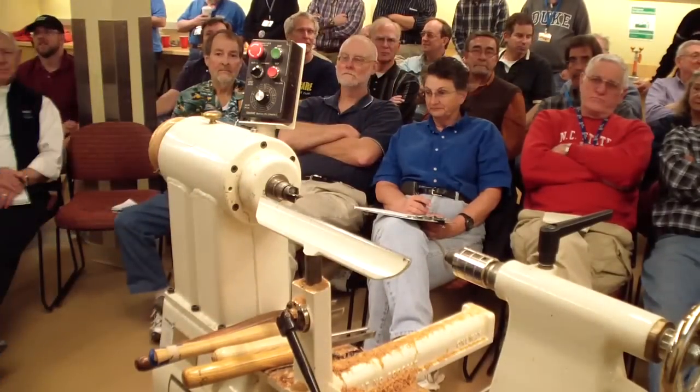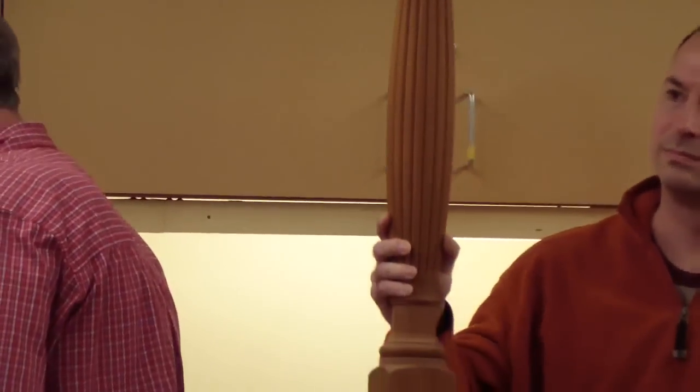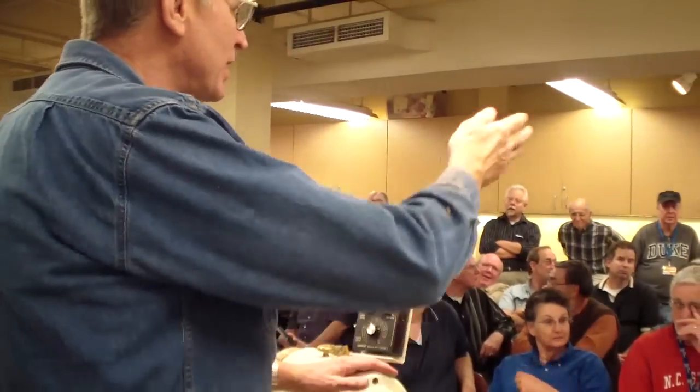Okay. Back there on the back is a sample of reeds. There's some threaded stock. There's some indexing wheels. You can see that one there. That's a reed jack. And if you look at that carefully, you'll see one of those reeds is too narrow. When you do your indexing wheel, if it's got any slop in it, make sure you always turn the same direction. Don't go backwards. If you had to go backwards too far, and then bring it back up so that it always keys at the same exact distance each time. So I kept that one because of that.